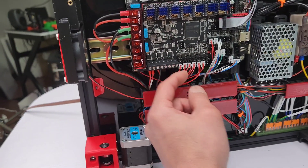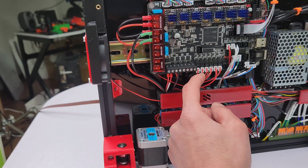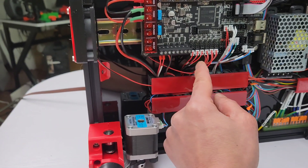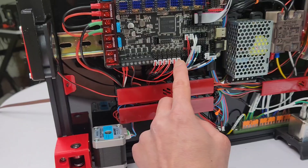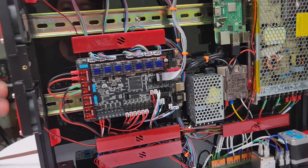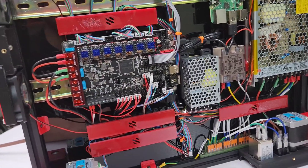I've got six fans connected. The first two are the extruder heater and hot end fans, plus print fans. I've also got two Nevermore filters with two additional fans for those. I didn't print skirts yet, but I definitely recommend at least having two fans to cool down the drivers, which you'll want if you want to run at full speed.